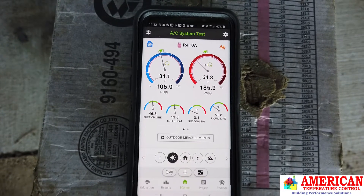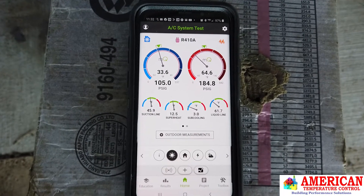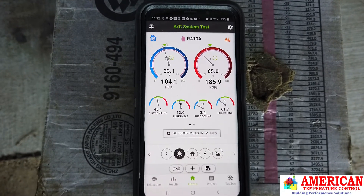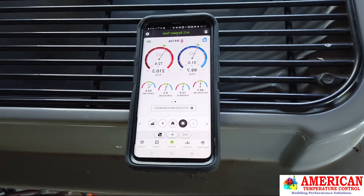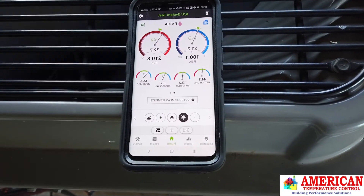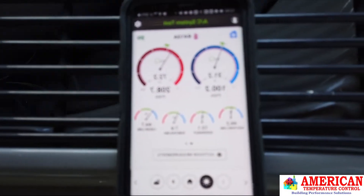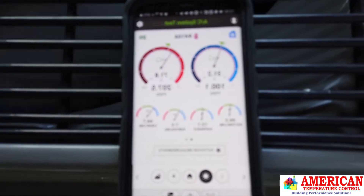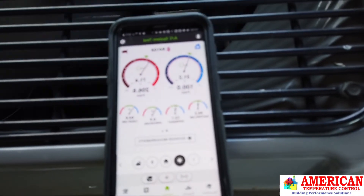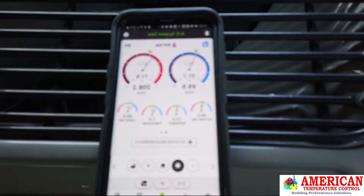We're getting close — we'll just let this run for a little while, come back and take a look at it and see where everything balances out. Let's measure quick — I think I'm going to call it quits here. We're not looking too bad, we're off a little bit, but it's only 60 degrees right now and the house doesn't have much of a load, no humidity at all. So we'll make another stop out here when it's a little bit warmer and there's more of a load on the house.